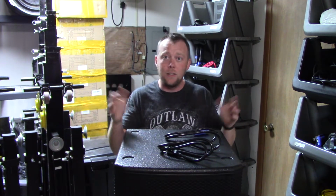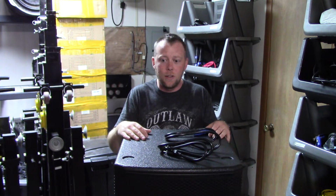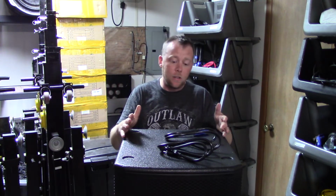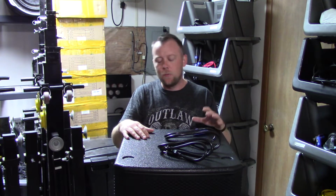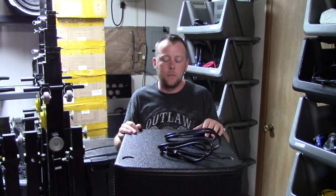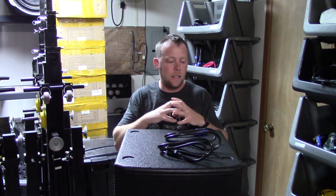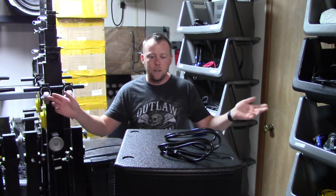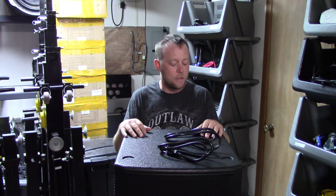But now I'm questioning that because I'm still going to be putting full range through the little 6.5-inch drivers, whereas on those, I would think, cross over the system at 100 hertz and call it good. If you run full range to your tops and a sub, one thinks, oh, well, you're just adding up the sub. But no, it really can make the mix muddy, because with bass frequencies, depending upon where your sub is from your other sub, you can cancel things out, you can get phase issues. There's just so many problems when you don't cross over your tops.